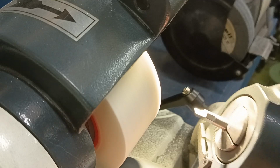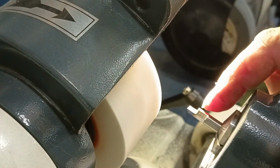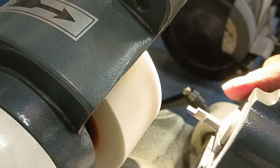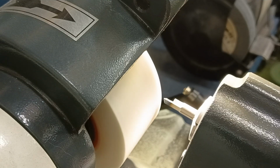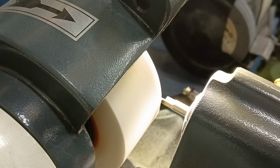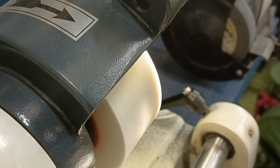Now, what I can't do with a hexagon cutter is rotate that for the relief. I can only cut the angle, and I can't rotate like this half turn thing because I'll wipe off my facets. So, we'll come in here, we'll bring this over a little bit square, and of course all I need to, I've run out of travel, I think. Yes, I have.